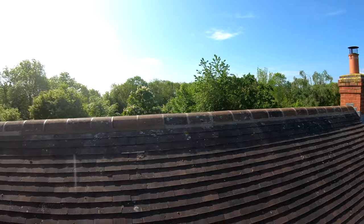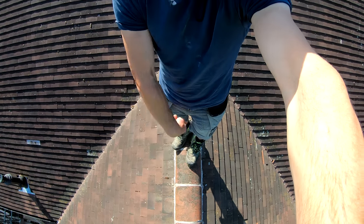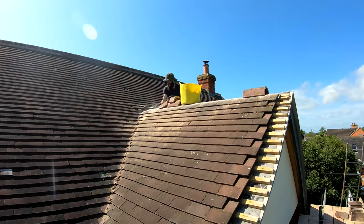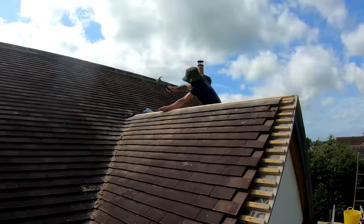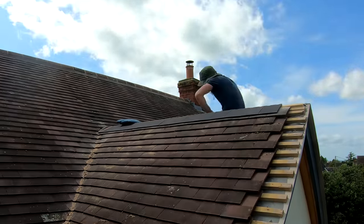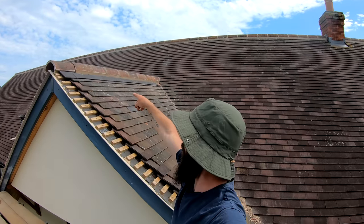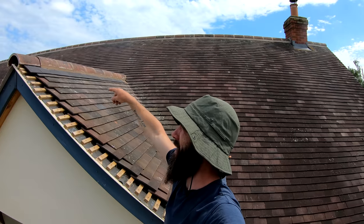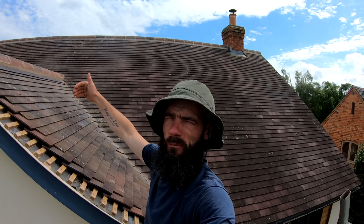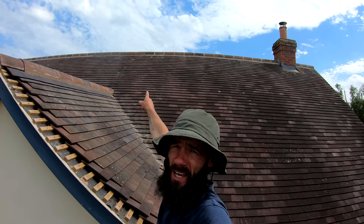That's the ridges behind me — all done, all the way down there. Just got them little bits done there. So the next plan is to get these ridges all in here, stripped off, clean them all off and get them re-bedded on. Beautiful day — another one of them days you're glad to be a roofer. That's it for today. We managed to get all them ridges off and I've put an extra course in there. What they did before, there wasn't enough cover with the ridge onto the tile, so I've just had to put an extra course on top just so we've got plenty of cover with them ridges.